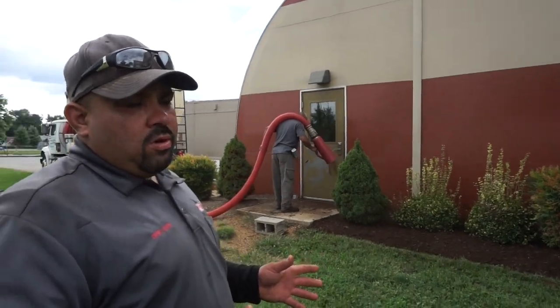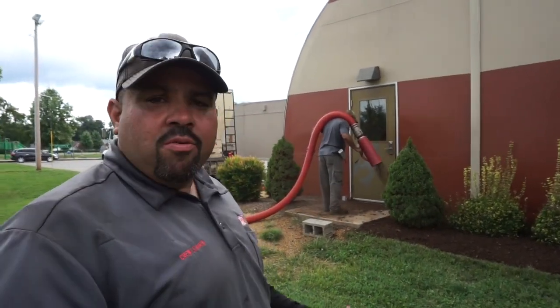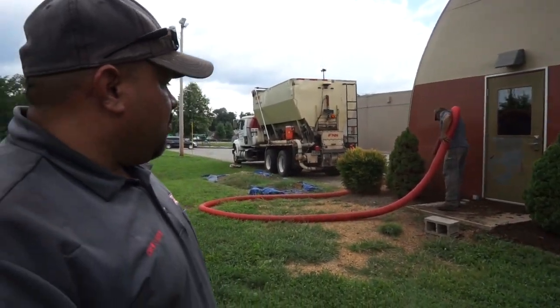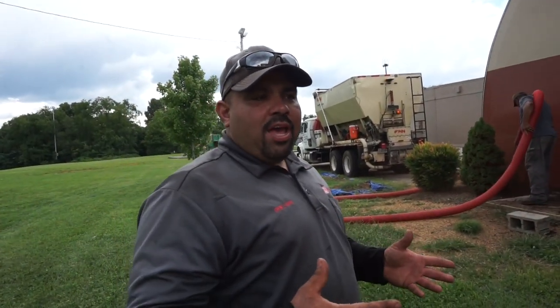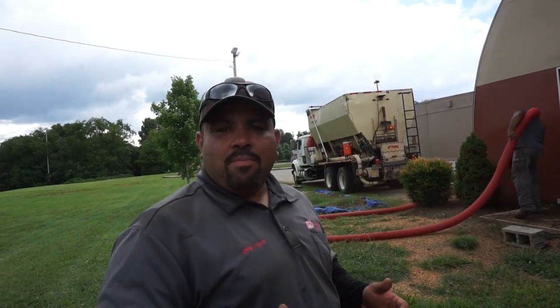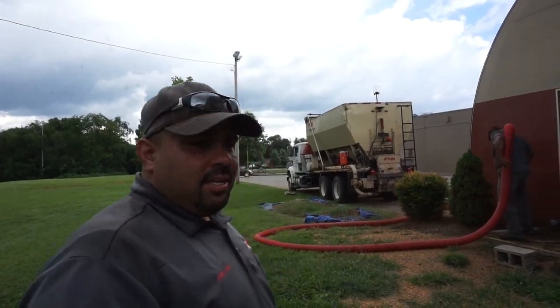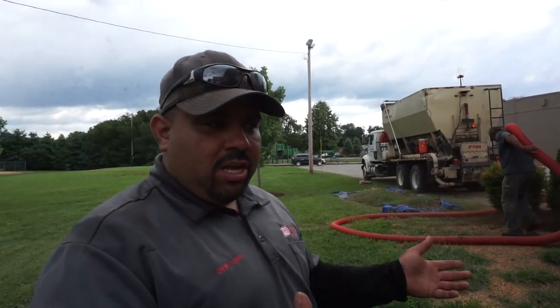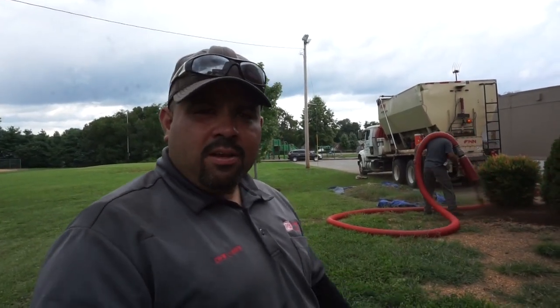Job, you want to do an inch and a half. If it's a brand new install, you want to do 3 inches. As far as knowing how much you have when you're shooting, you just got to eye it. You get better the more you do it. If you're not sure when you first start out, just check it periodically and make sure you put down the right amount.